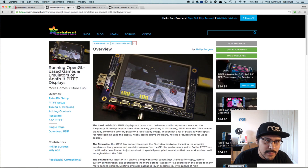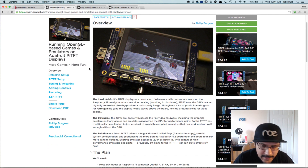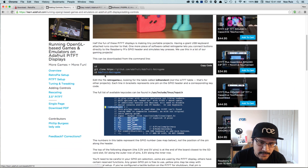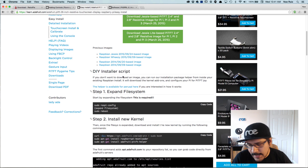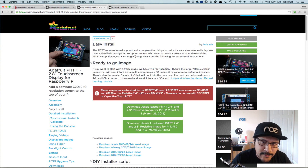If you follow the link here, Phil B's guide is for running OpenGL-based games — RetroPie basically — on Adafruit Pi TFT. This guide will make it work for different types of Adafruit Pi TFTs and different Raspberry Pis. Unfortunately, I found it doesn't quite work so well with the Raspberry Pi 3. So we're going to use the adding controls portion of the tutorial to make the Pi Girl gamepad work using Adafruit Retro Game, and we're going to use the Adafruit Pi TFT easy install DIY scripts to get our 2.8 resistive touchscreen to work with the Raspberry Pi 3. This is only for the Raspberry Pi 3.